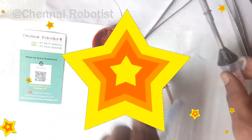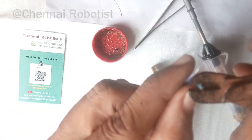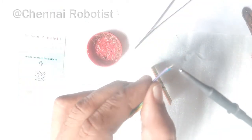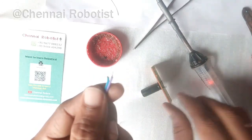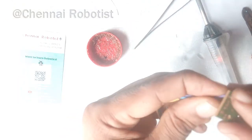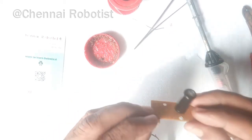Next, let's see how to solder a wire. To strip the wire, use a cutter and just slice — not completely through, otherwise you'll cut the wire — then you can peel the insulation off. Put the exposed wire into the soldering paste and apply a coat of paste, then do the same tinning coating we did for the component. Once you have completed this coating step, it's very easy to solder the wire into the board at the required pin.